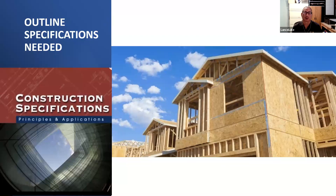There's framing, siding under the frame, trim, and all that. In a wood repair project it's the opposite — it's called deconstruction. In simplest form, you're removing bad wood and replacing it with good wood. But you have to select siding that matches, ensure a moisture barrier like a Tyvek system is installed, specify what kind of nails, caulking, and paint to use. It's not just removing a piece of wood and replacing it.